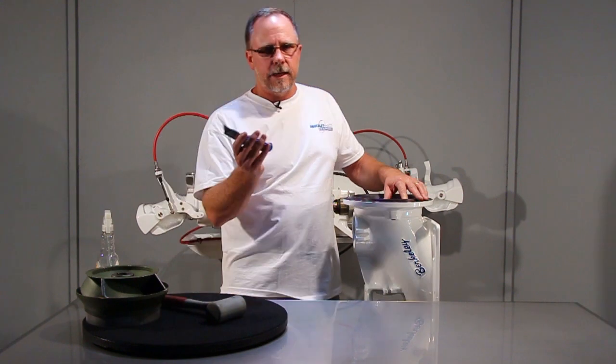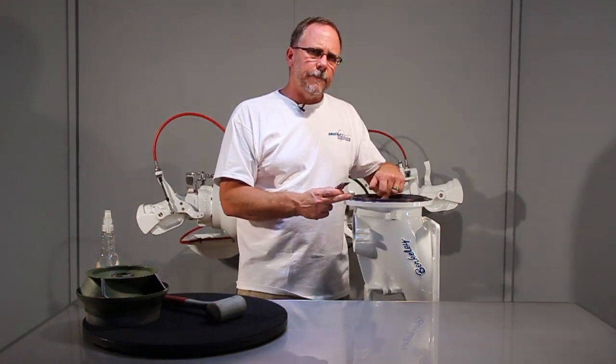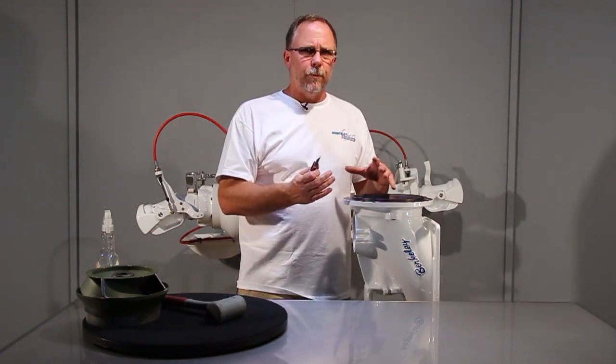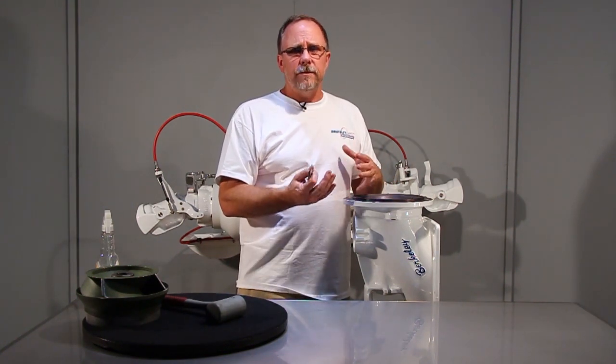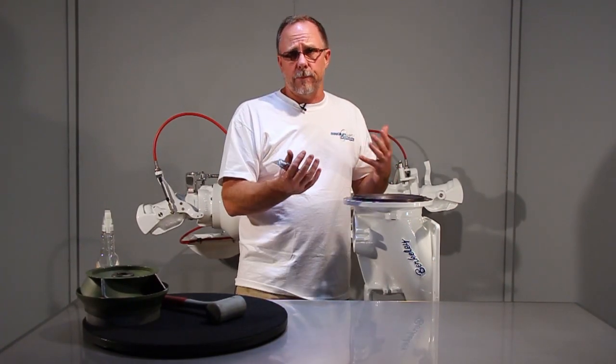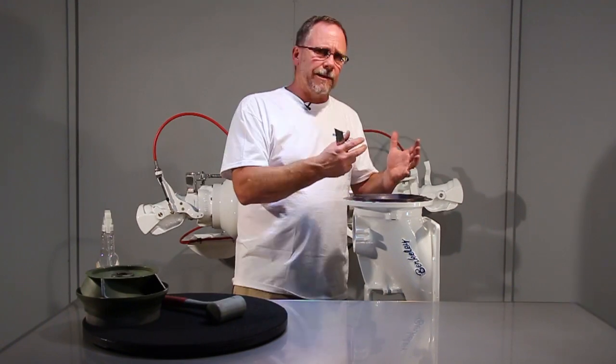The other thing I like to do is take a razor knife and come in and cut off the little lip that runs around inside of the wear ring. If you're doing any kind of blueprint work, it helps keep the impeller from getting up into that area from tightening, which closes up the clearances and causes problems when you get that boat back to the water.